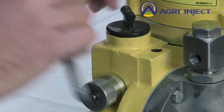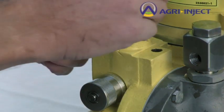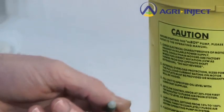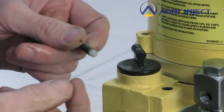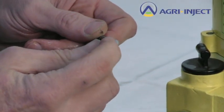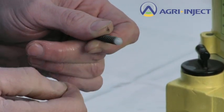Right at 14 turns. Underneath that set screw is a spring. On the bottom side of that spring is a white plastic Teflon cone — this is your poppet. This will determine where the oil bypass is set. If you have a groove on that cone that catches your fingernail, it should be replaced.